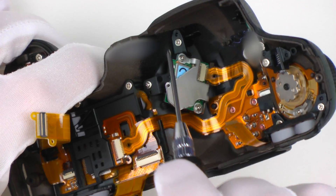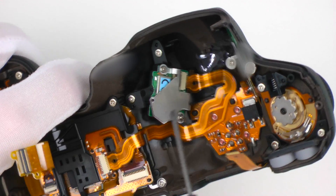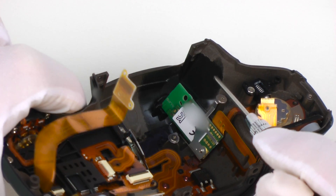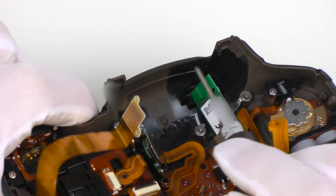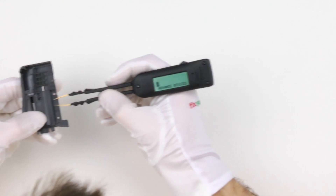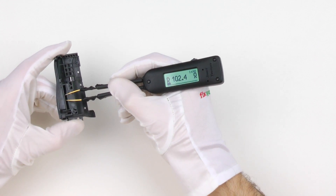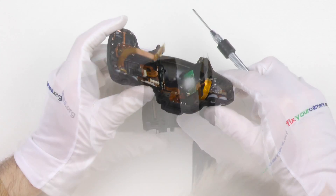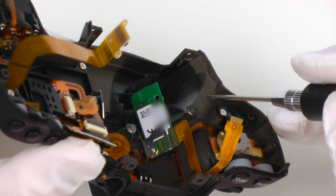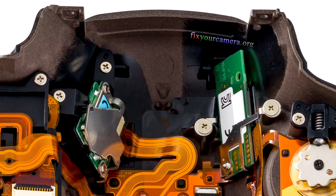Top cover — there are two tiny modules hidden inside: one of them is GPS and the other one is Wi-Fi. The top cover is made of plastic, and it has to be, because otherwise the signal wouldn't be able to get in or out from these modules. All covers in cameras are either made of metal or they are metalized from the inside to shield electronic parts against EMI or RF signals from the outside world. But around these modules, there is no metalization at all, which is exactly what you would expect to see.